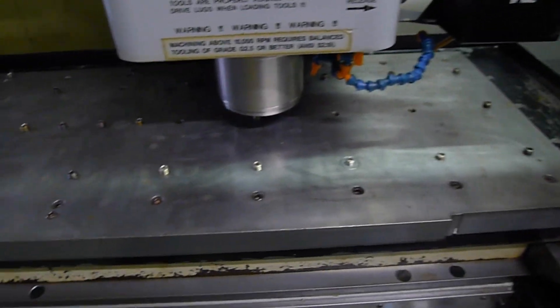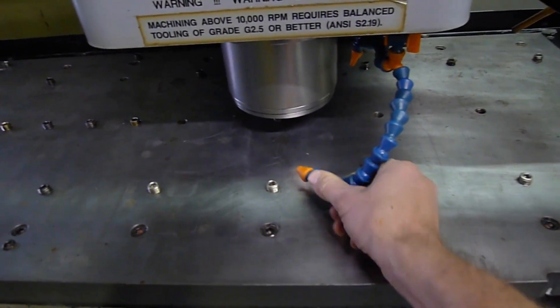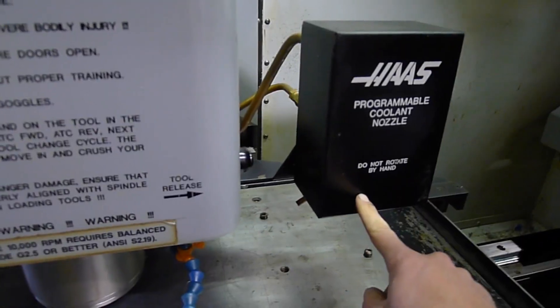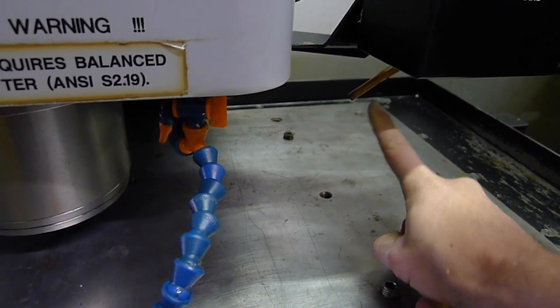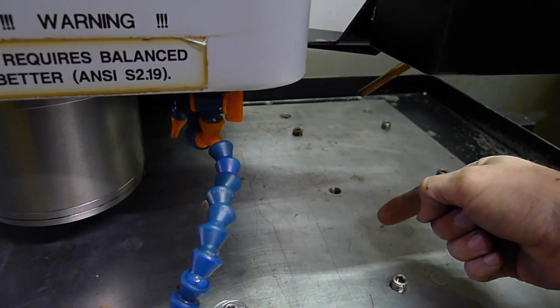I'm at the front of the mill here. The spindle is all the way lowered for a separate reason. You have these coolant lines, these little flexible hoses, and this is for flood coolant — this will spray the coolant. You have what they call P-Cool, for programmable coolant, and it has a nozzle here which through the program you can adjust how high or how low it goes.